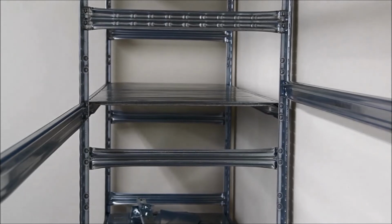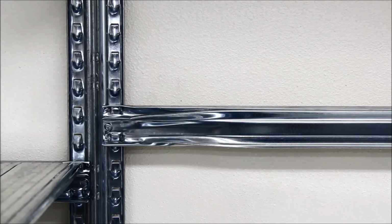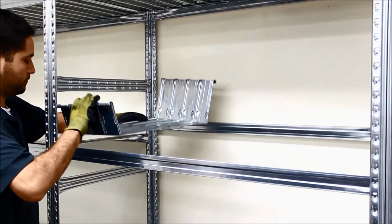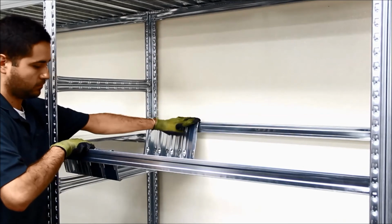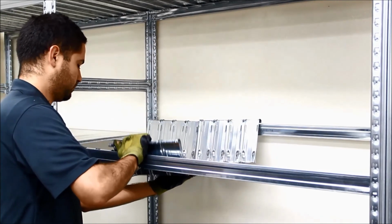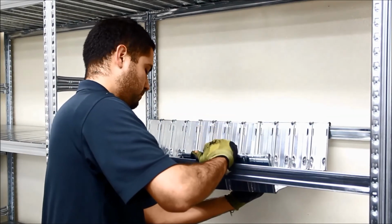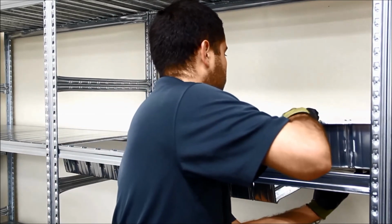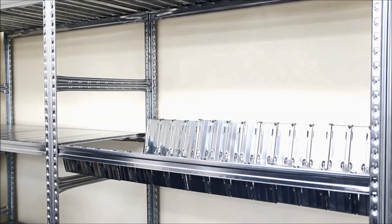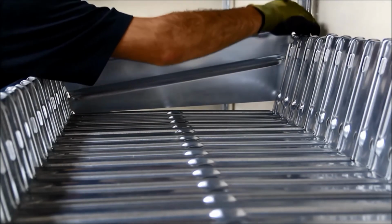Modular containers. To assemble the containers correctly, the rear beam should be fitted 2 inches higher than the front one. Insert the containers from left to right and join them together by overlapping the beginning of the following container onto the end of the preceding one, pressing them into the recess of the beams. Fit the dividers into the special slotted seats, pushing down to locate.